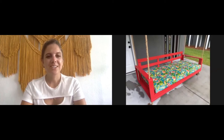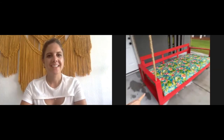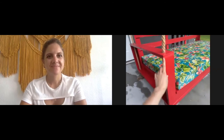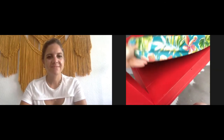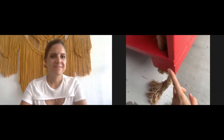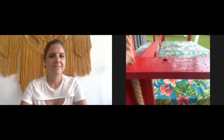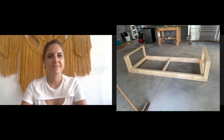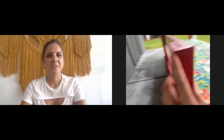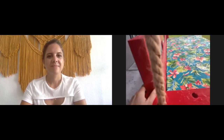Wow, you built it yourself — you cut all the pieces and put it all together? Yes. The arms are made with one by fours, and then underneath the cushion we've got one by eights lining the bottom. On the bottom, I've got two by fours running underneath — these are the support structures that the ropes are really attached to. So I'm not putting any weight on the arms; the holes are really just to keep the ropes out of the way. The whole thing is really supported by these two by four rails on the bottom. In the back, I've got some more one by fours and then a little one by two to act as an end cap so that it has a nice finished edge.